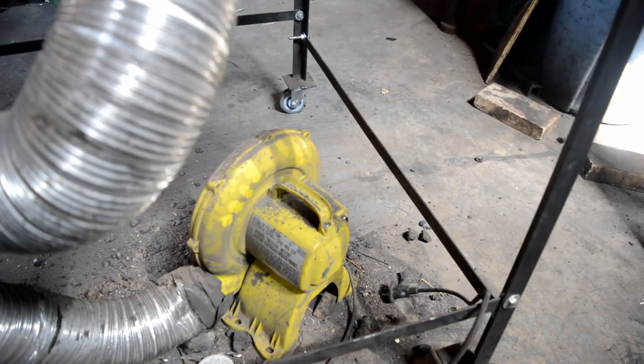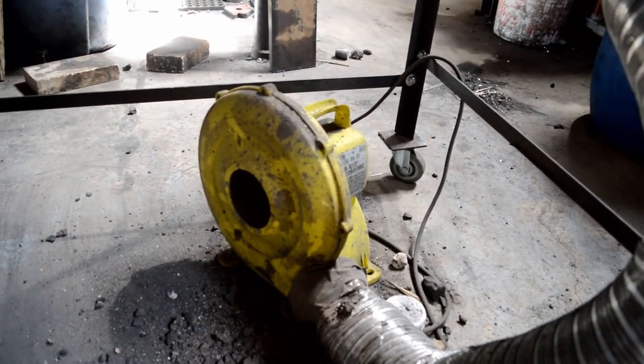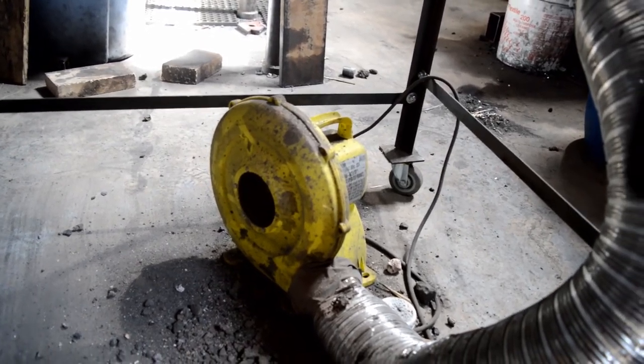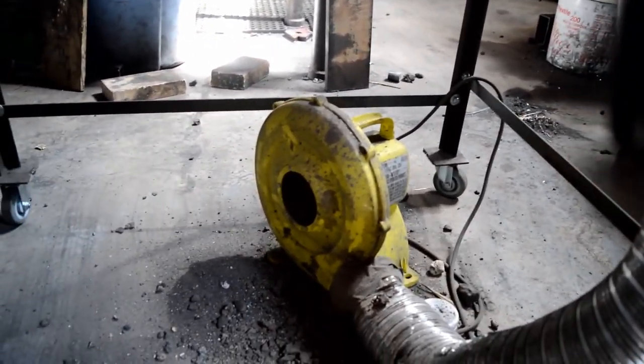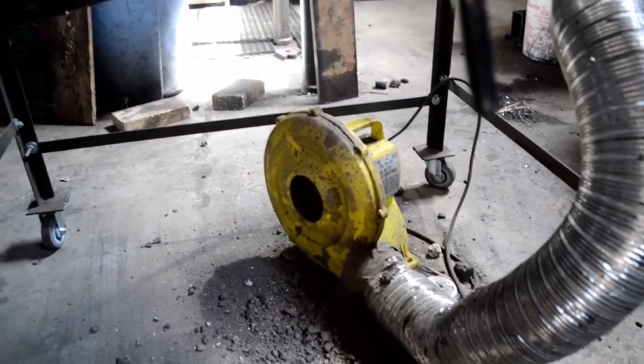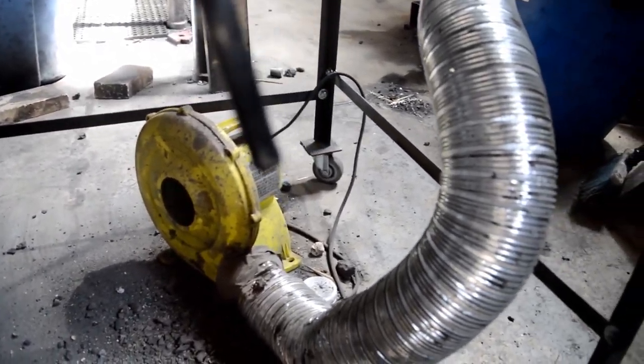You will need a good air source when powering a forge. This is a bouncy castle blower and it has a very strong blast. The disadvantage of this is that it runs at 85 decibels — it is very loud and unpleasant to be around without hearing protection.